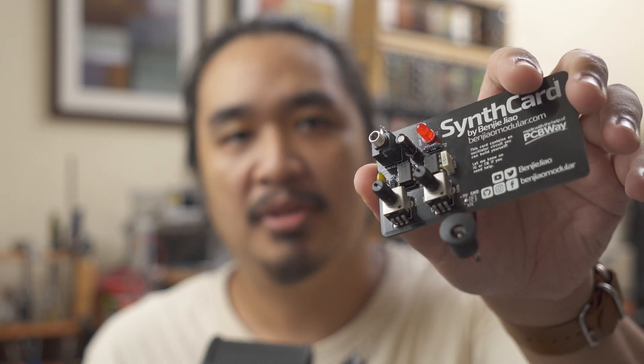The circuit is based around the Atari Punk Console. It's a beginner-friendly SynthDIY project with only two knobs — the first one is frequency and the second one is pulse width. I also like this circuit for its very minimal parts count. It can be powered using a 9-volt battery or a pedal power supply. If you're about to build this, it helps to have the schematic diagram as a reference. You can find those on my website, linked in the description.